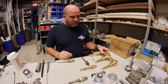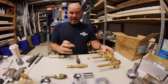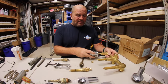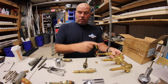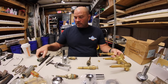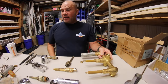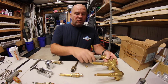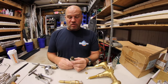In case we miss shots on our next job, here's everything that can go wrong when you try to repair a faucet. You're in the wall with the old tile going here. First thing — get the handles off. If you don't strip the screw, you have an opportunity to take the handle off with the handle puller: boom, it goes on and you pull off the handle. Now you've got to go into the wall — it's generally in the wall or flush with the wall where you can't get channel locks or an adjustable wrench, so you need the tub wrench. You get a bite on the stem, use a screwdriver. With the water off, you snap off the stem on the first try, it breaks free, you unscrew it.